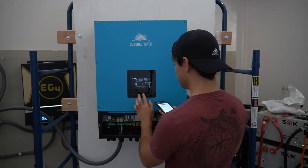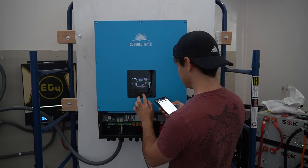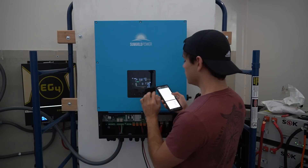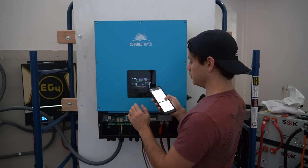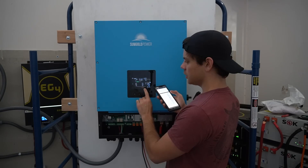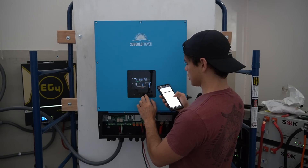There's a way to do a factory reset when it's connected to the software, but not with the screen, so we're just going to go through every setting and ensure everything is perfect. Setting one: 120 volts. Setting two is output frequency: 60 — that's good. Bulk charging could be a little higher. It has a low DC cutoff battery voltage when grid is unavailable — I actually like that, it's a pretty cool feature. We're in off-grid mode, and setting number 19 was not on the default — I changed it to that so it might actually fix it.